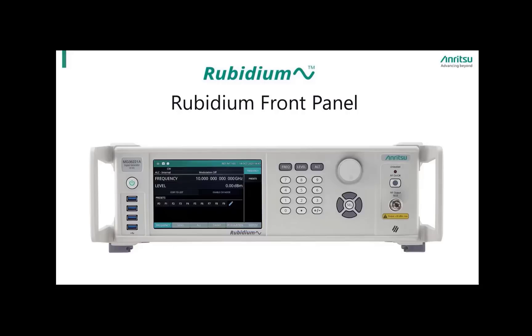The next section on Rubidium covers the front panel buttons and knob. Starting from left to right and top to bottom, the top row buttons in a darker shade are function-specific buttons that will take a user directly to that function. Below these buttons is a traditional numerical keypad including a period for numerical resolution. To the right of the keypad, there is a rotary knob used to change the value of a parameter that is open for editing. Slowly turning the rotary knob will increase or decrease the parameter values depending on the step size. Below the rotary knob is the cursor control pad, used to control the direction of the cursor when editing a parameter.